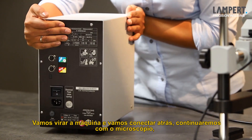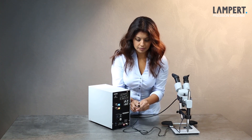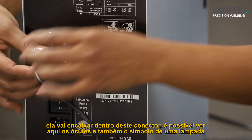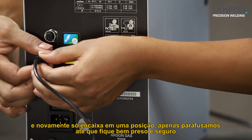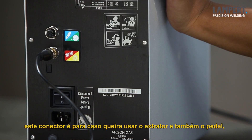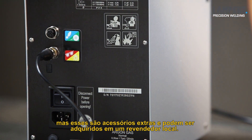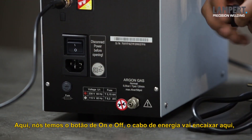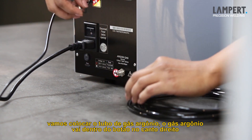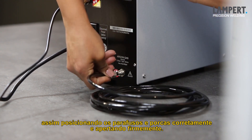Let's turn the machine round and put up the connectors on the back. The microscope also has another lead that comes out of the optics. This is a nice long lead coloured in red and yellow on the end, and that will fit into the socket here, which shows the glasses and the light symbol. That pops in only one way — slots into position and we just screw that down until it locates nice and securely. This socket here is if you want to use the extractor and also the foot control, but these are additional accessories. Down here we have the on and off switch. Here is the mains lead that will fit into the bottom. The argon gas tube goes into the bottom right hand corner — that is a simple push fit, and then the nut comes across and screws that into position, nice and hand tight.